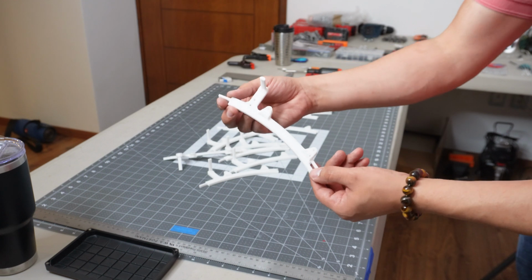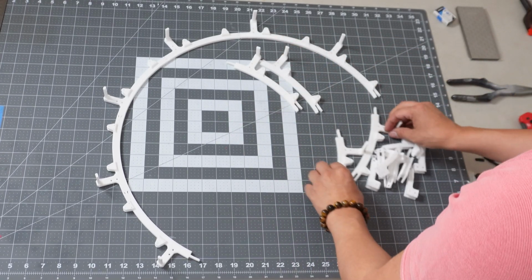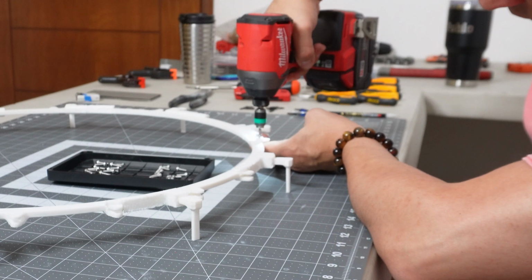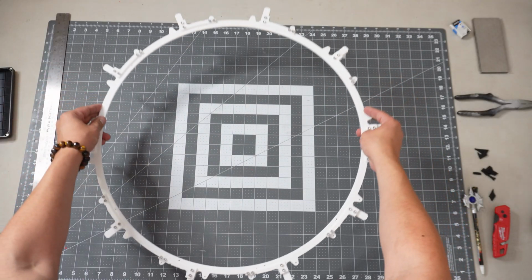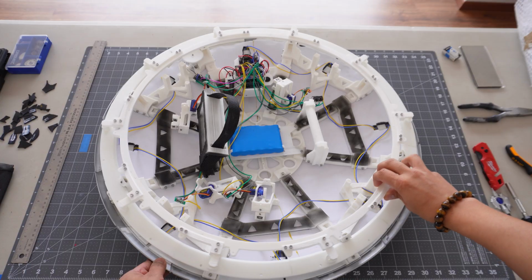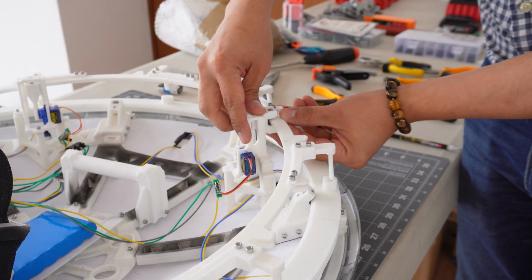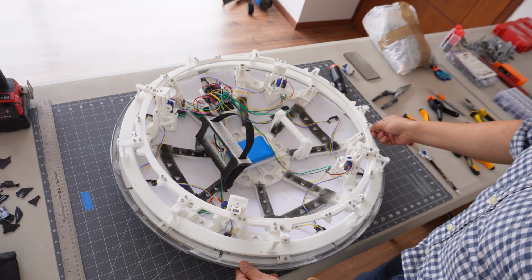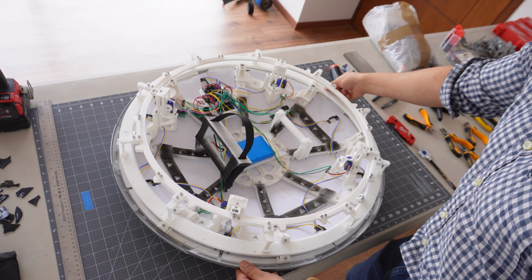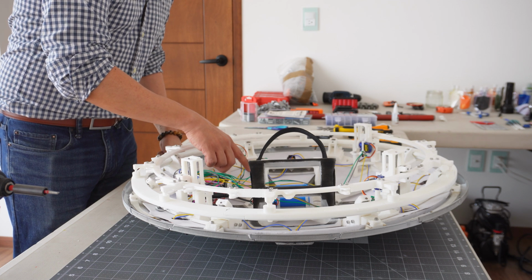So this is where I built the second ring, with different characteristics compared to the first one. It is joined by screws instead of glue. Plus it has this kind of spike that enters in the first ring. This is so it rotates at the same speed, and this is the one that the 4 assemblies with the servos are going to hold. This way it rotates at the same speed as the first ring, but still can be pushed in and out by the servos without moving the first one. But how does that affect anything?